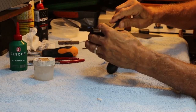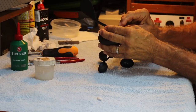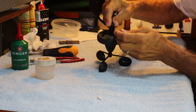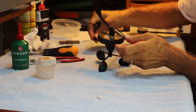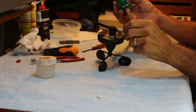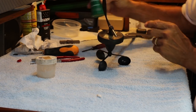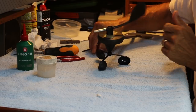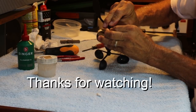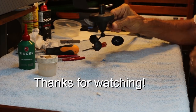This goes back into the housing and pretty much snaps back in place on the mounting shaft. I'm not going to put the screw in on camera to save time. The final thing is to pull this cap off of the wind direction sensor. There's another bearing just inside and I'm going to give that just a drop of oil. I've never had this freeze up or had any problems with it, but just to make sure. Just one small drop of oil, then put the cap back on. As soon as I put that screw in, everything is done and ready to put back on top of the mast.